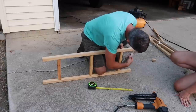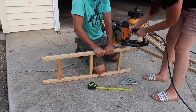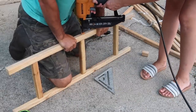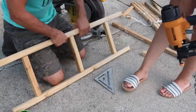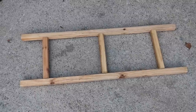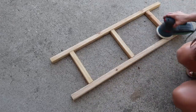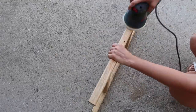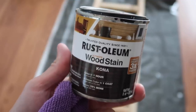This ended up being about a 35-inch long ladder. The rungs — the top and bottom ones are about 6 inches away from the ends, and in between each of them is about 12 inches. We used a nail gun — I don't like using one, but this one wasn't that bad, and my husband did most of the nailing. I probably should have sanded and stained before putting everything together, but it all worked out in the end.